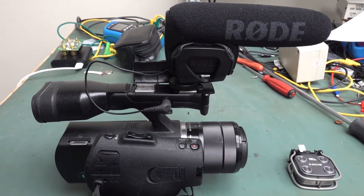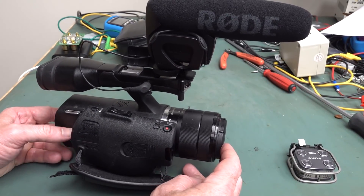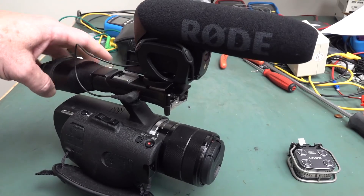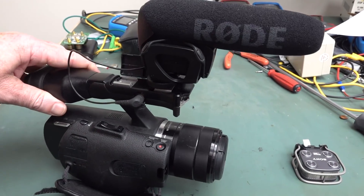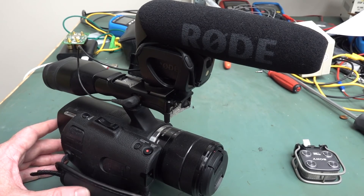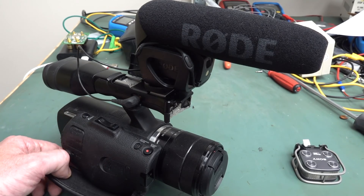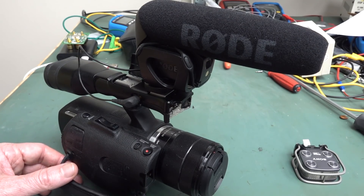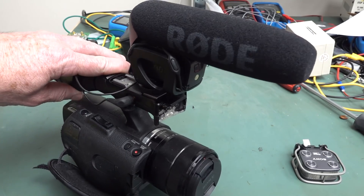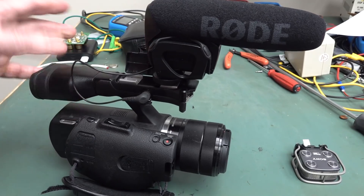The problem with having the camera way back on the other side of the room is that I can't just hold stuff up to the camera. So I thought I'd go back to this and just use my shotgun on top. Shotgun microphones aren't perfect, and when you're inside with echoes you've really got to be about a meter away from the microphone — meter and a half at most. Anything beyond that it just doesn't work properly; you get too many echoes.